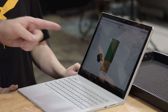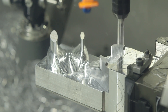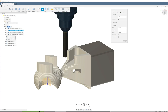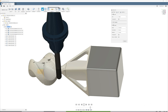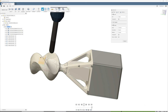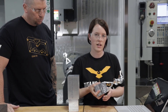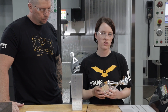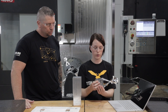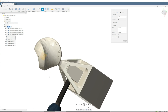The first pass is adaptive, so let's simulate it. We start by roughing this area out, then flip it 180 degrees and do the same exact operation on this side. Then we do our ball tracking - we start on this side and rotate it all the way around, doing the same thing on the other side. The process is exactly the same as the building blocks - the only difference is you're just rotating the part with each operation. Then we take a face mill and do this surface because it's flat, and with five-axis we just rotate it so it's perpendicular to the shell mill.